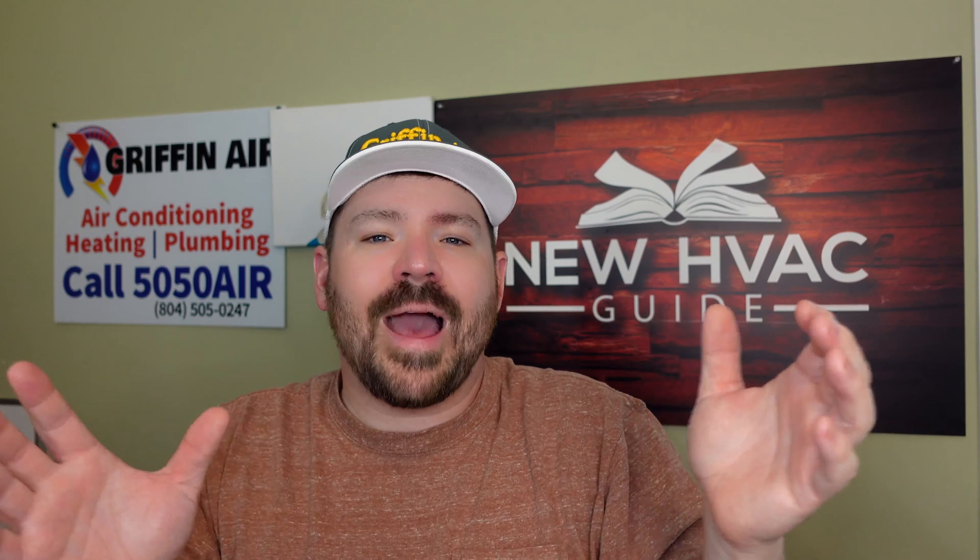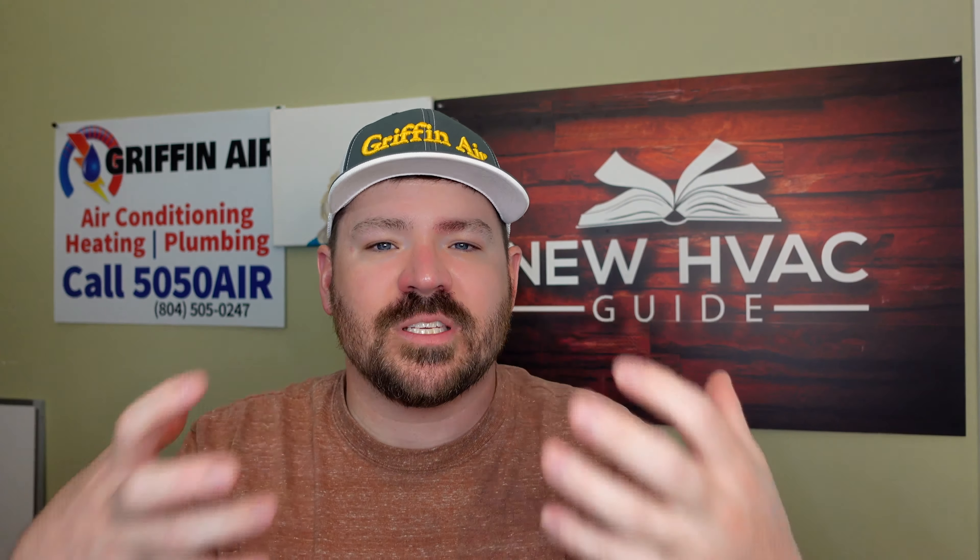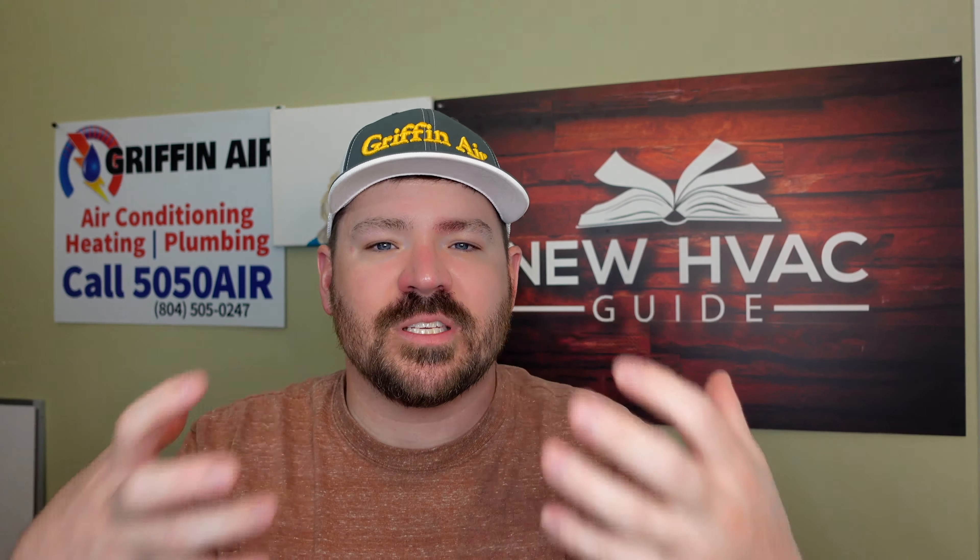Merv 11 rated filters are pretty good. They're way better than those disposable ones that you put in your filter grills. Having an Aprilaire filter with a Merv 11 is like a disposable filter on steroids. Because it's Aprilaire or some sort of other four-inch media filter, regardless of the brand, having that four-inch thickness with what I call the ruffles — it's the surface area that really matters. It's not necessarily the Merv, but the fact that you have all that extra surface area means you can still get high Merv 11 and reduce static pressure in your heating and air system.